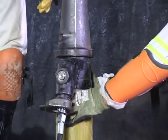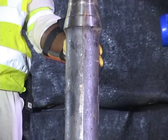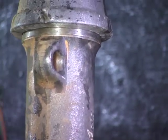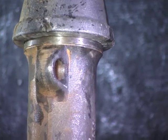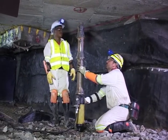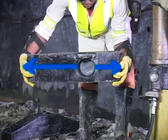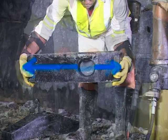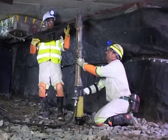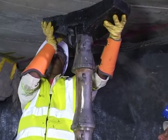Place the required prop extensions including the load spreader onto the prop to a height of approximately 300 millimeters from the roof prior to activating the setting pump. A range of load spreaders is available, including LDPE manufactured load spreaders such as the off-center load spreader and the center load spreader. Position the load spreader on top of the prop extensions and align to suit fracture orientation.